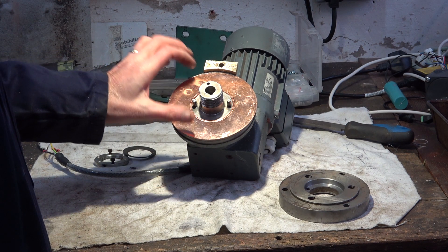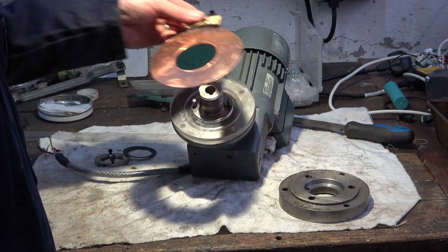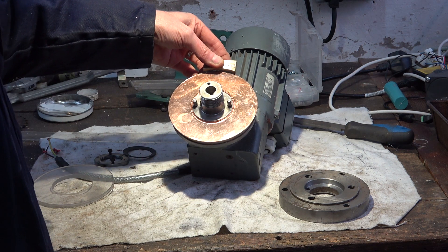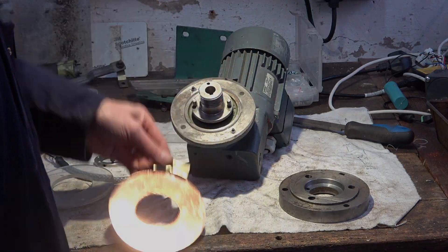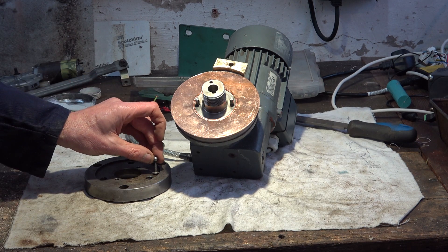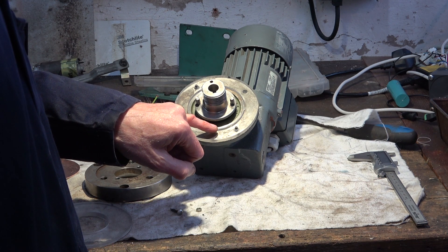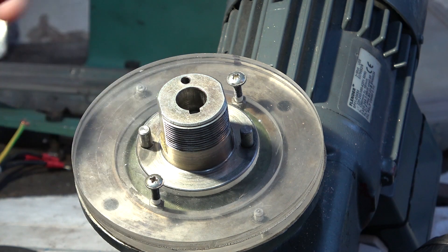I need to find a way of fixing this so it can't spin. The idea is to put some screws through here and here, because the screws can run through into this cavity behind. I don't think there's going to be a massive turning force on this, so although the screws are near the centre rather than the outside, I think it's going to be fine. The screw heads need to sit in this recess — it's 2.7mm deep and I've got some screws with a head of about 2.5mm, so they'd sit in there without interfering. I found some little flat nuts that sit within this first insulating ring. Holes drilled there and there, so now I need to spot through this plate and shorten these screws. That's done I think.